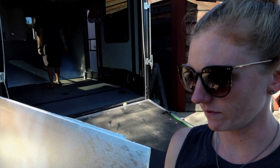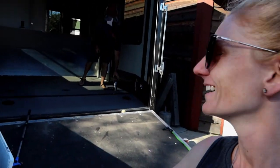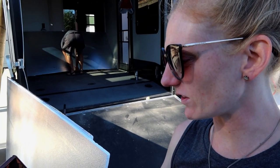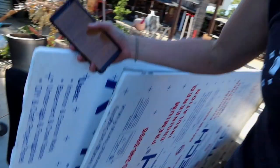The question is which side of the insul-foam R-tech faces up, because one side is metallic and one side is not. I googled it — it says the metallic facer on insul-foam R-tech may provide additional R-value if it's facing a dead air space of three-quarters of an inch or more. If there's no dead air space, it doesn't matter which way the metallic side is facing. So we're going to put the metallic side up. And that fits perfectly.